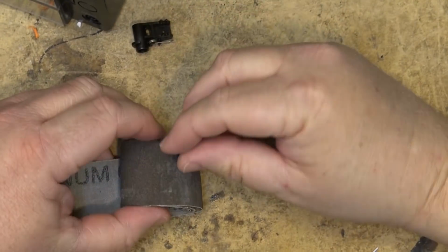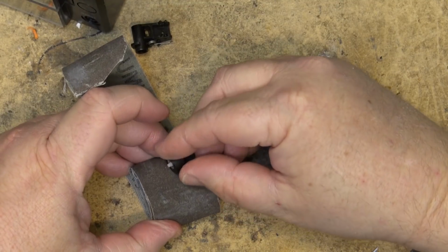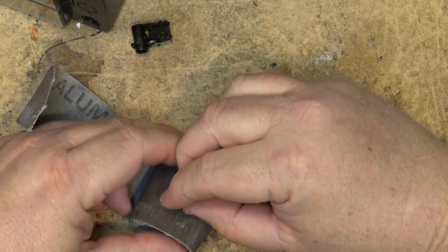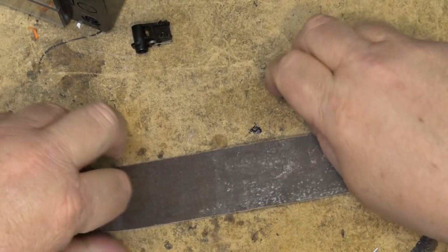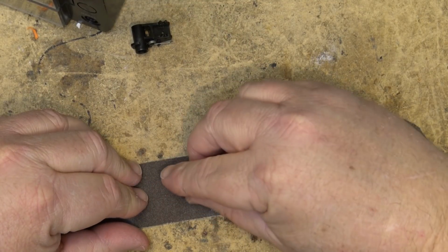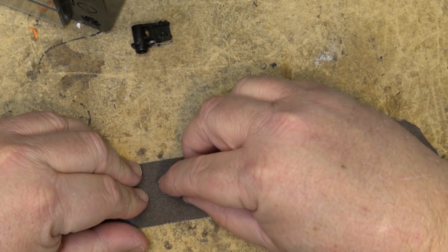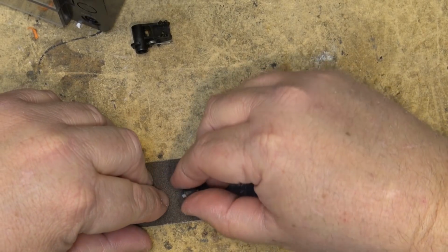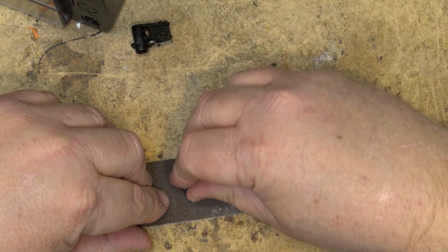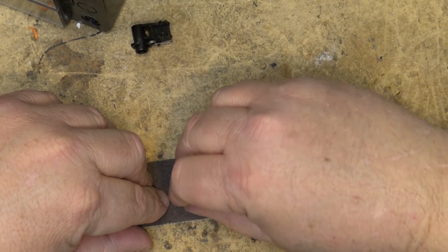So I'm just going to roughen up the edge or the surface of this slightly by just rubbing this pinch roller slightly on some aluminum oxide, just to try and break the surface tension here because it's really hard, and I don't know whether this roller is going to come back or not, or whether we're going to have to try and find one.